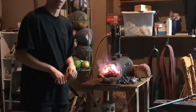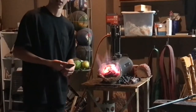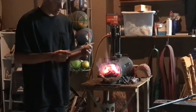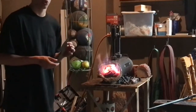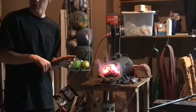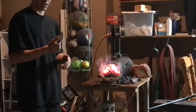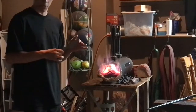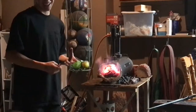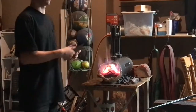I believe that if I apply a bit more knowledge of metallurgy to this heat treat, it will come out with higher quality than some of the others I've done. I have everything surface finished up to 220 grit hand sand, which in my opinion is a minimum. I do prefer to hand sand — you're able to achieve much more organic shapes via hand sanding, and just a much more natural look than you can get on the machine.